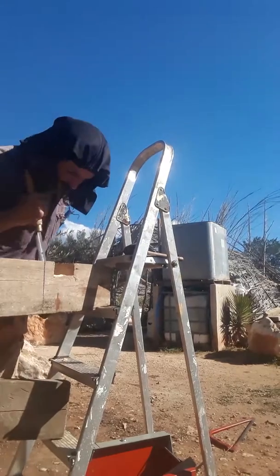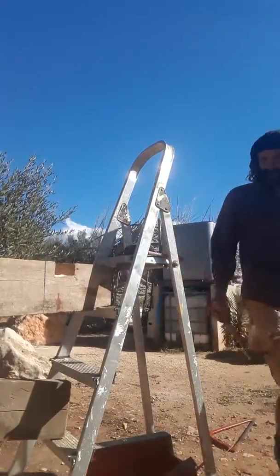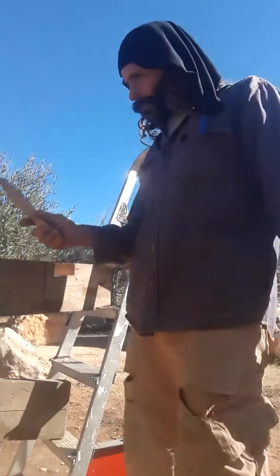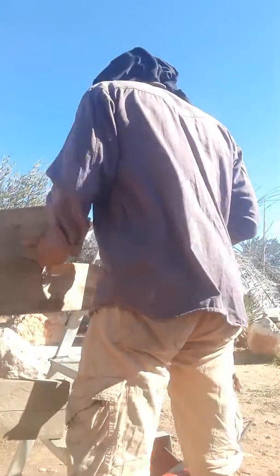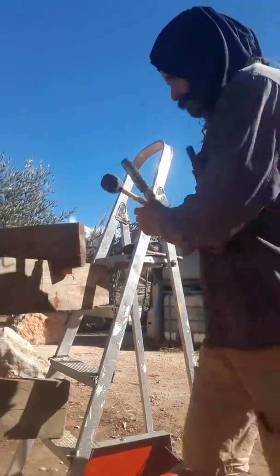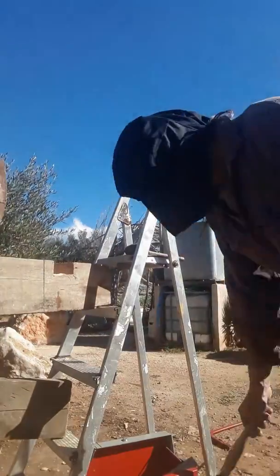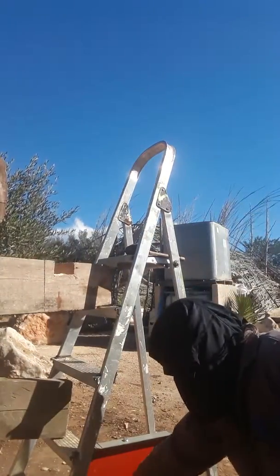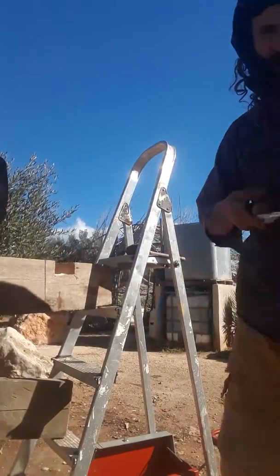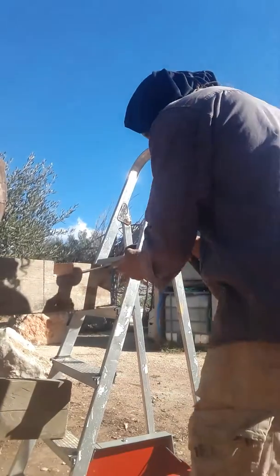I've got down to my line which is five centimeters deep, and I will do a commensurate cut on this one so that when it sits in there at five centimeters deep they will be interlocking. And then I will peg it. I'm going to change my chisel now — again, we have the chamfered edge — and I'm going to literally finish off.